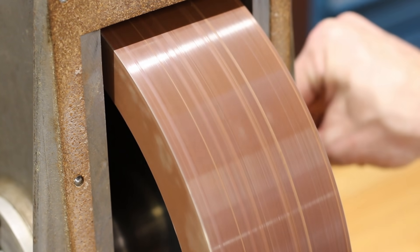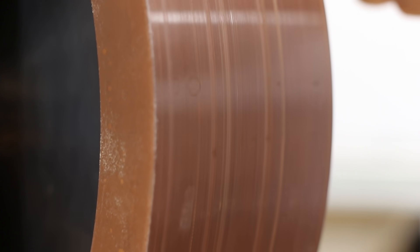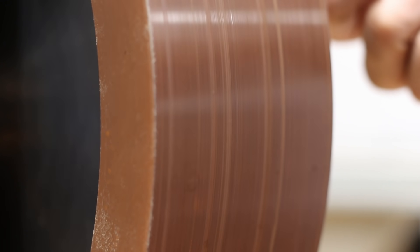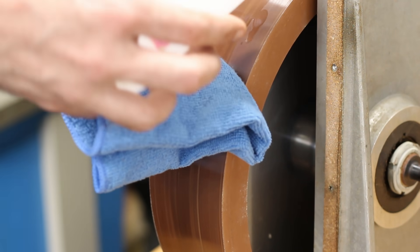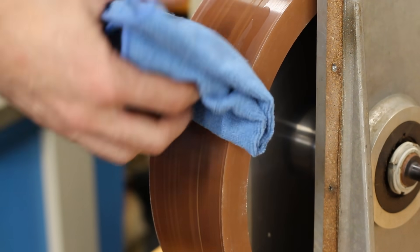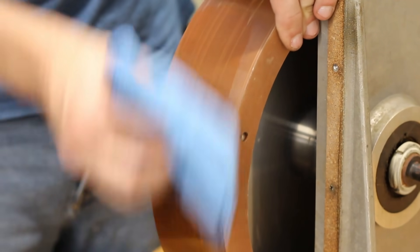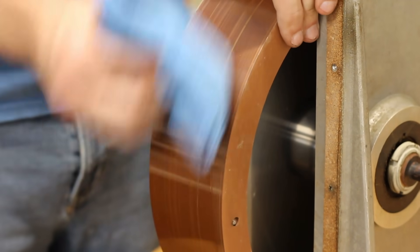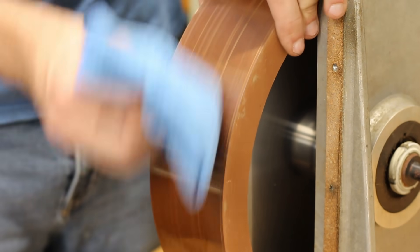You can really see just how badly crashed the drum was. Looking closer at the surface, there is definitely evidence of water intrusion — little black spots, water spots, and all sorts of other nastiness that could easily crash the heads. I'll give it a wipe down with alcohol and a microfiber cloth, which is what we use to clean hard drive platters, so it should be totally fine here. While it definitely cleaned up the gunk, it mostly just confirms that the stripes that look like head crashes indeed are head crashes.